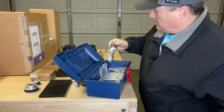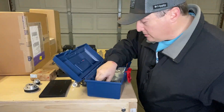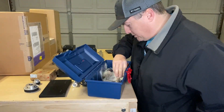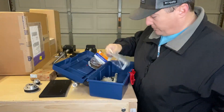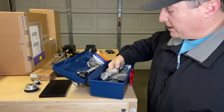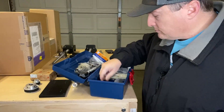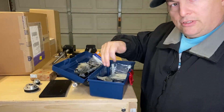There's an adapter for the arbor, like for a shell mill, and this is like for a drill press — a Jacobs drill press adapter. That's a wrench probably to lock it so you can get tools in and out, and Allen keys. This looks like a cover plate for something — I think that goes on the spindle to hold it so you can tighten the tools in and out. The bottom is like an R8 — it's got a taper down here and it's straight with the key way, so that allows you to slide tool holders up there like a collet holder or whatever. Same thing here — this is a blank for a drill chuck, like your drill press keyless chuck or you use a Jacobs key to get drills in and out.